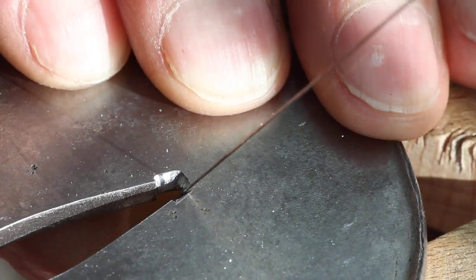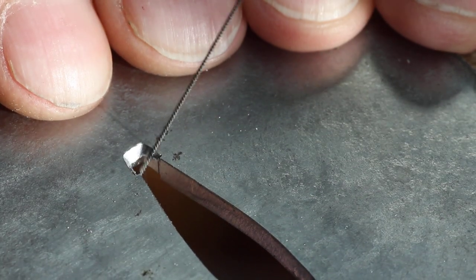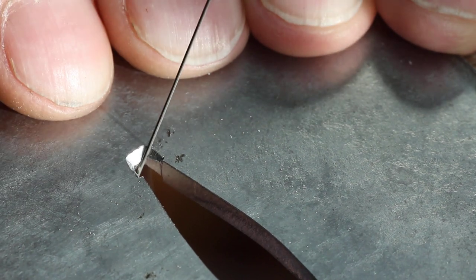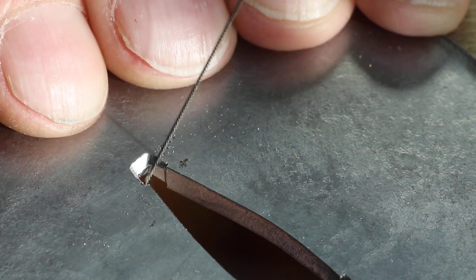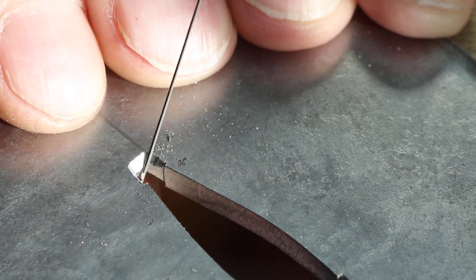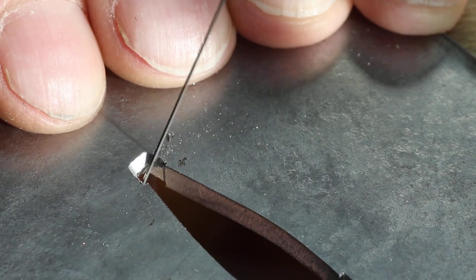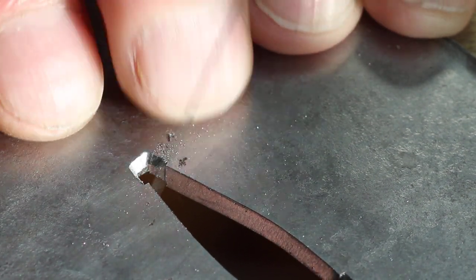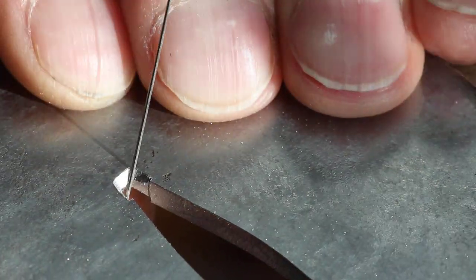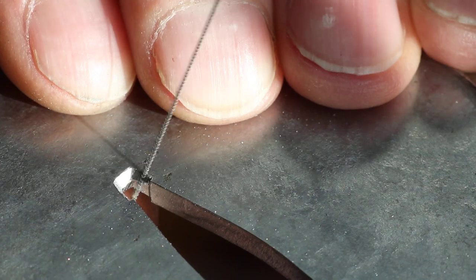It's the kind of technique that used to be used for opening up the mounting for diamonds in pavé setting. You'd even do the conical seating for the diamonds with a saw frame. And the back of course can be cut open to provide an opening for light to get in. They would carve with a blade either a square or a rope-like pattern. There's no end to what you can do with a saw blade when you start to use it more like a very fine file.